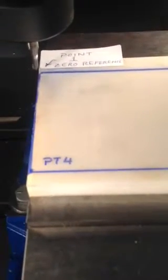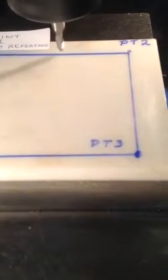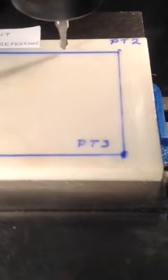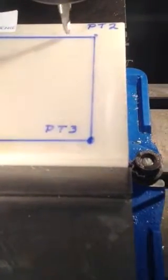Now it's going to move over at 12 inches per minute to point number two, which is X five inches. Notice we are on the Y zero line. The spindle is turning at 1,000 RPMs but for some reason the video doesn't pick that up — it looks like it's going in slow motion, but it is moving at speed.